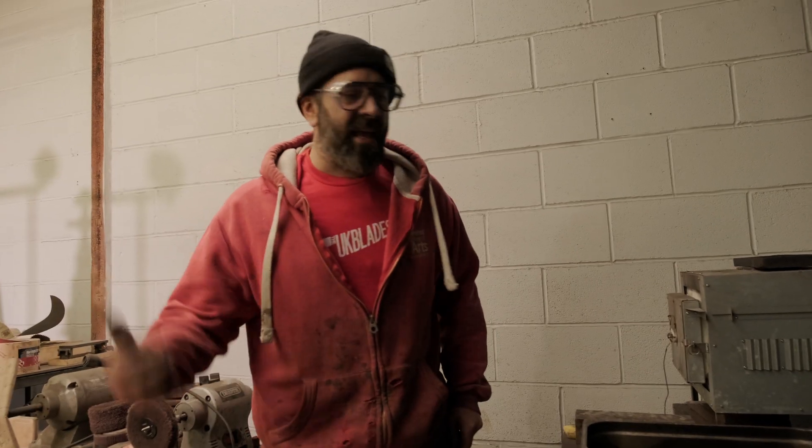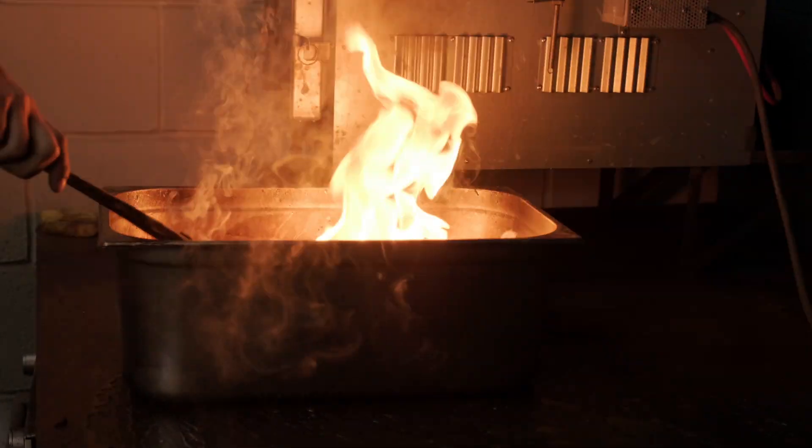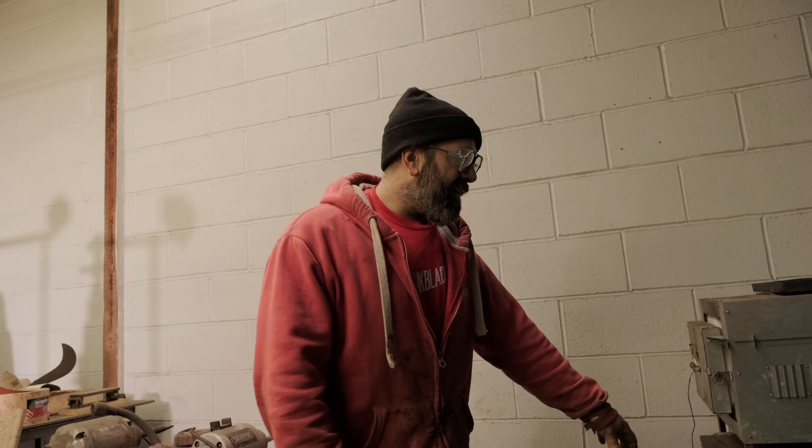What we're going to do as well is get this oil ready. I'm going to take a couple of bars of steel, get them up to temperature — up to a yellowish heat in the forge — and stick them in this oil, which is Rye Quench 50, the fast Rye quench. It's not massively quick when it's cold, but heated up it gets a little bit faster because it's thinner. The thinner the medium, generally the quicker the quench — water quenches quickest, thin oil quenches fast, thick oil quenches slower. It all depends on what steel you're using.